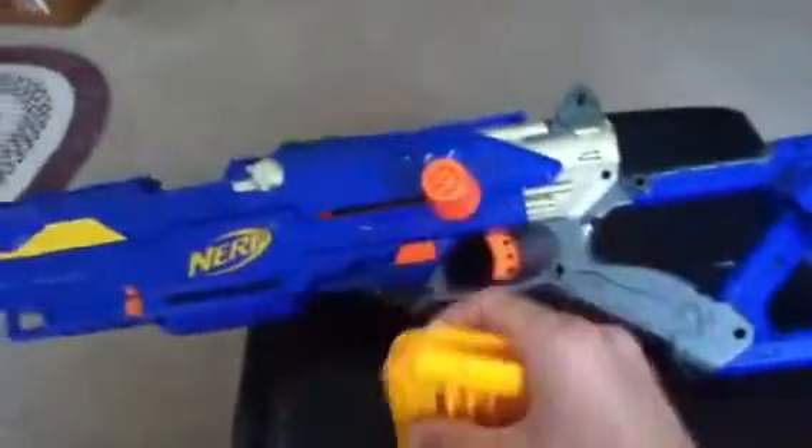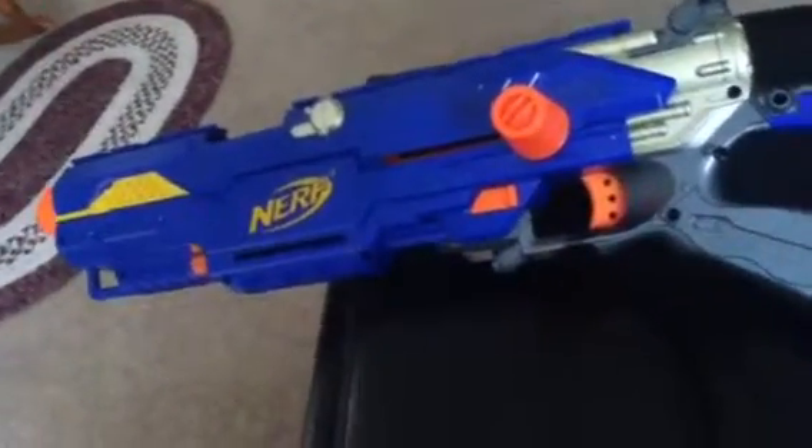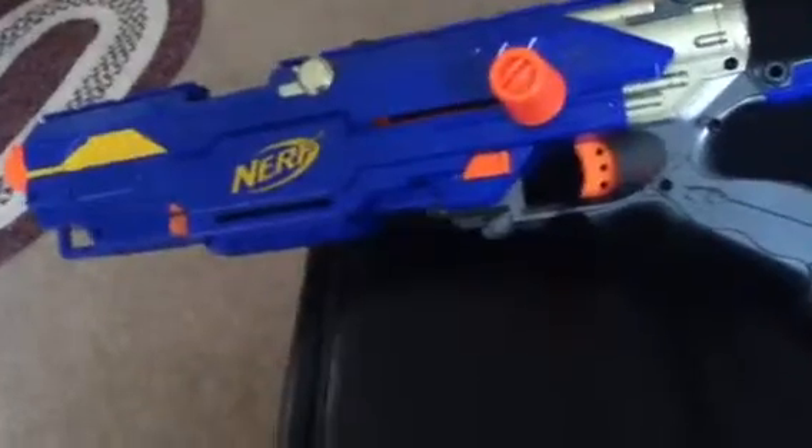So pull this back and take this clip out. What I did with this is took out the air restrictors, which is really a pain for the clip-fed ones. I think most of them are like this. At least this one definitely was — there's this long tube and you need to tear the tube apart pretty much. That's one way to do it. Or you can take a big hammer and a long screwdriver and just pound it out. The air restrictor turns into a hollow tube.